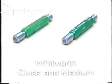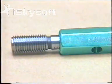When using helicoil screw lock inserts, it is preferable to use the closer class of fit. It permits the locking coil to work as specified within these tighter controls.